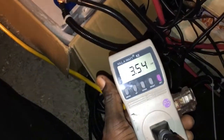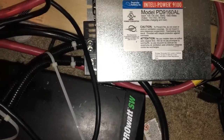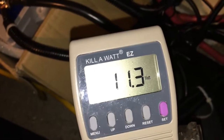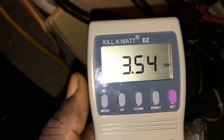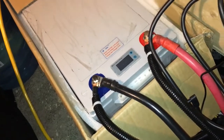Just wanted to show that it's fully charged back up — 22 degrees Celsius. The kilowatt meter is showing it took 3.49 kilowatt hours to recharge. Even when the Progressive Dynamics charger is done it still does a maintenance charge of about 20 watts. So to summarize: 2.4 kilowatt hours discharged took about 3.49 kilowatt hours to actually charge back up — about an extra kilowatt to put the energy back in. I'm going to do another test so stay tuned.